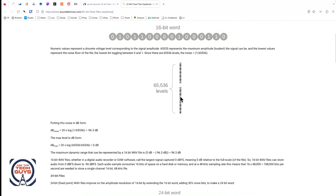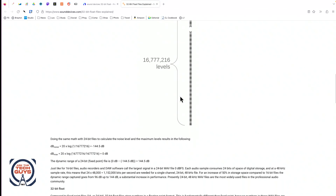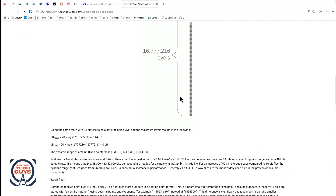With 16-bit CD quality, your dynamic range from the lowest sound to the highest is about 100 decibels. So the quietest sound — like a triangle going 'ding!' in a symphony — is 100 dB below the loudest sound where the whole orchestra is playing as loud as they can with the timpanis pounding. 24-bit gives you more dynamic range: instead of 100 decibels, 24-bit gives you 145 decibels.